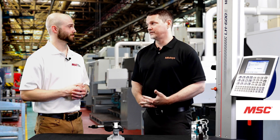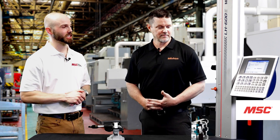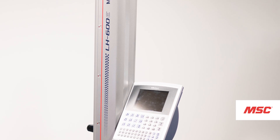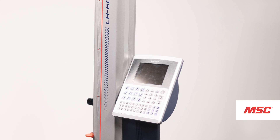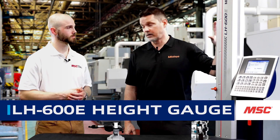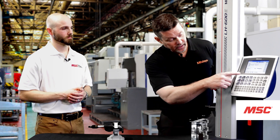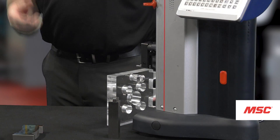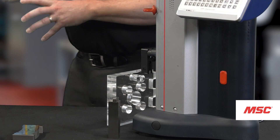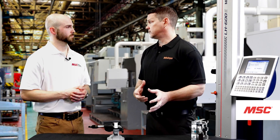We've covered the gamut of your world-renowned hand tools, but it looks like we have another unique device right next to us — what is this? This is one of my favorites. This is our Cadillac of height gauges. You see standard manual height gauges on the shop floor, but what I like about this one is it's extremely accurate — 1.7 micron accuracy — at a great price tag. For that accuracy, it's unprecedented; there's nothing else out there. And it is motorized: with a touch of a button you're getting your measurement, which gives a better, more accurate and more repeatable result. You don't have to worry about the operator coming down too hard on the part and affecting the measurement.